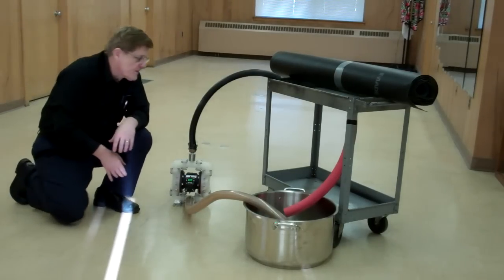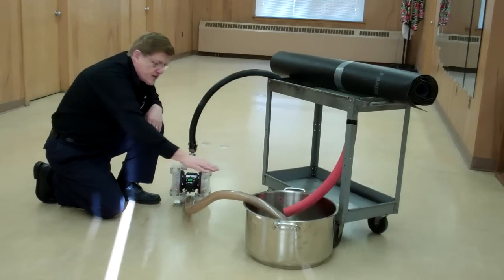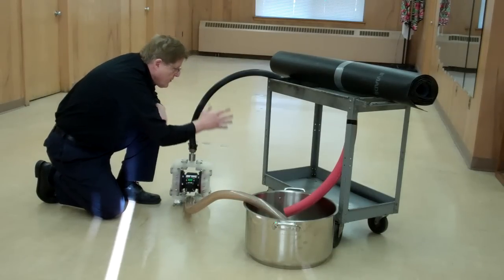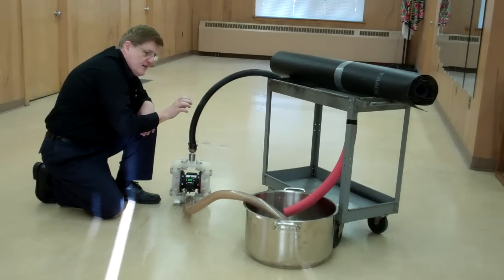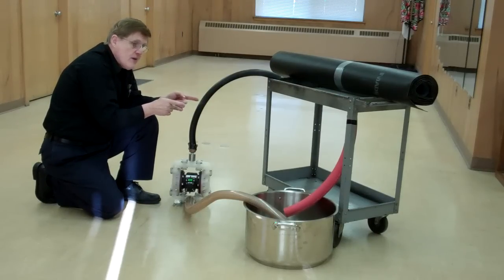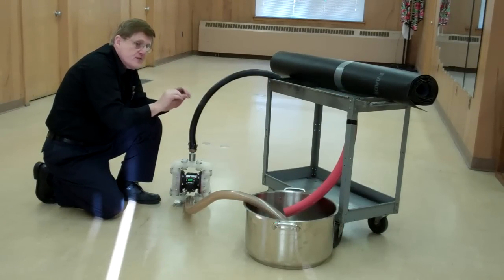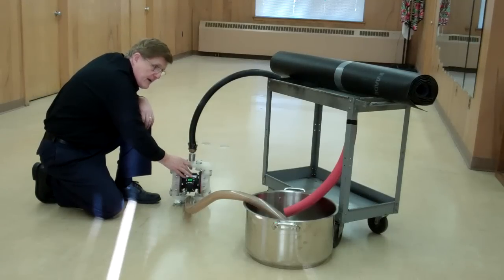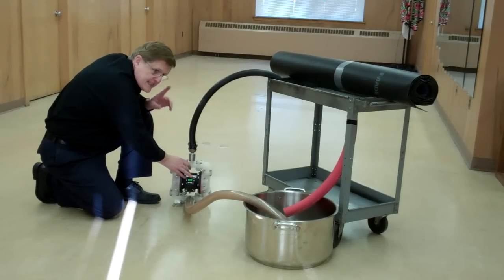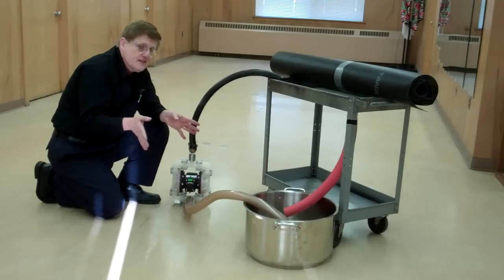In the world of gravure printing, on a simple gravure press, you can measure viscosity in the tank, in a line, or in a bypass. The Norcross in-line viscometer does not require flow to measure — any flow through our device allows us to measure viscosity. Much of our competition needs flow to physically operate their sensor and therefore requires more flow. Ours is simpler and easier to deal with; you can go directly in-line.